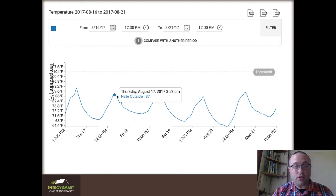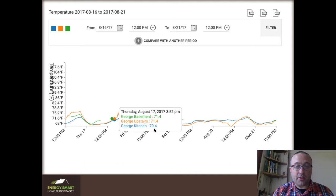Let's take a look at the next day, because this is more what I saw in the data. Instead of a 92 degree peak, it was an 87. Take a look at the temperatures here — this house is running really similar in temperature. In fact, for whatever reason, this day the temperature crashed on the second floor, so it was considerably lower than the first. Here you can see the upstairs and the kitchen are only a degree apart. If you see temperature differences of more than two to three degrees between any two parts of your house, something's wrong. Here's an example of a house built in the mid-40s with an addition in the 90s that has been fixed using home performance techniques and by choosing the right types of insulation and air sealing.